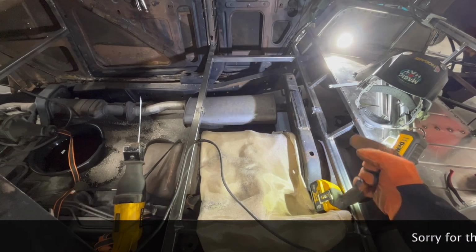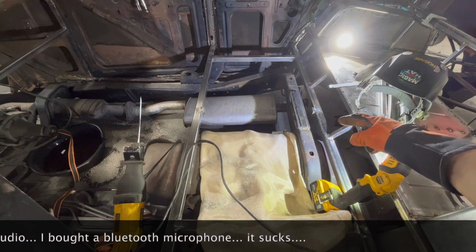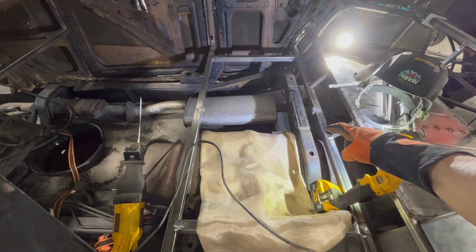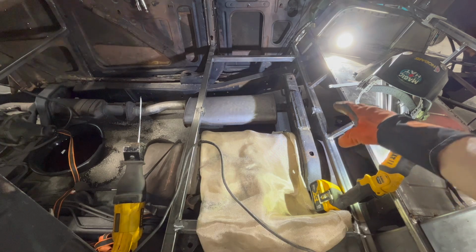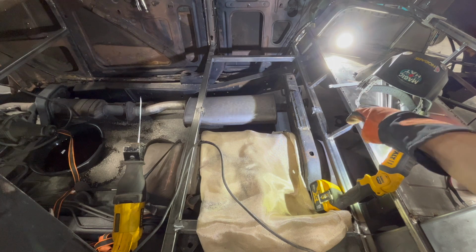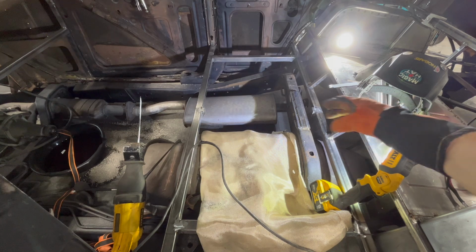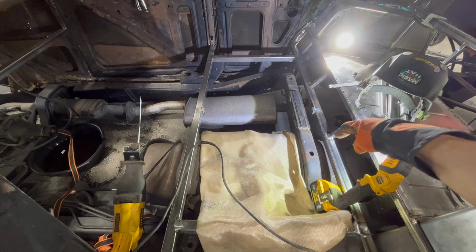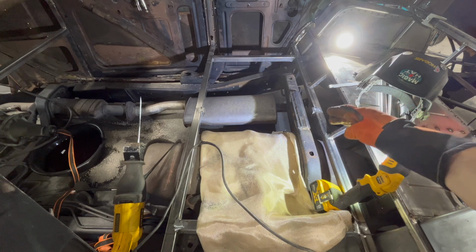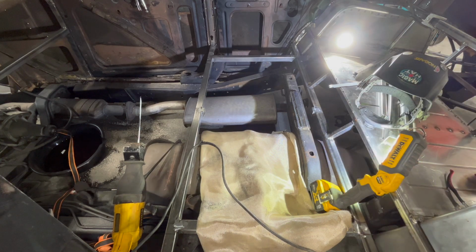All right, before I jump in on the other side, you can see what I did there is I started my cuts on the cross member. I got my pieces of 1/4 inch plate welded together there, so now it's 1/2 inch thick. So what I'm going to do now is tack it on the edges there so that the cross member doesn't weep whenever I cut through the rest of it. So I'm going to tack the corners, or maybe I'll just weld the whole thing in, and then once I'm done with that, I'll put the Sawzall blade back through the cut that I already made, and I will finish the cut on the bottom. Therefore, my drive shaft has clearance. Then I will take the pieces of metal that I cut to build my new frame for the skeleton for the floor, and we can finally put the floor in here. So yeah, that's the plan.